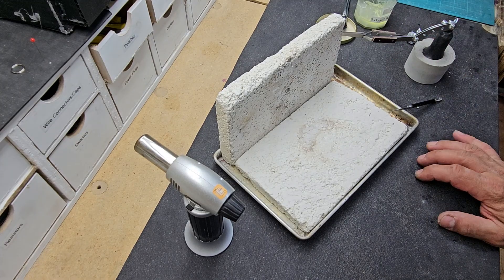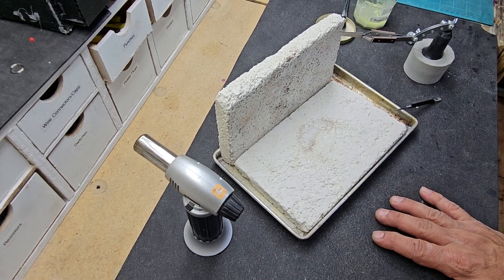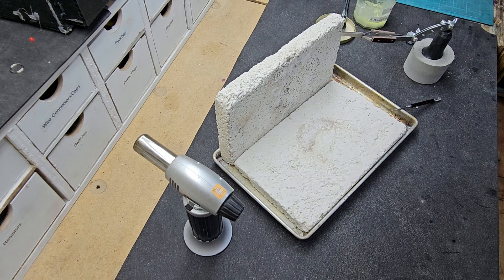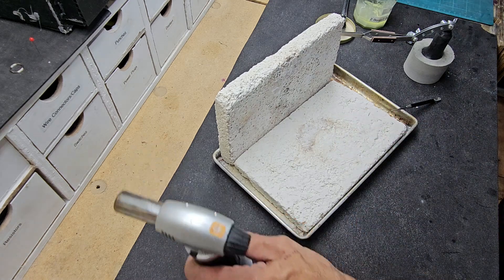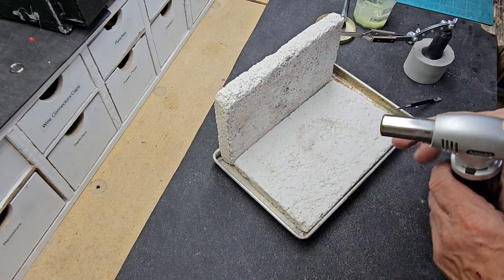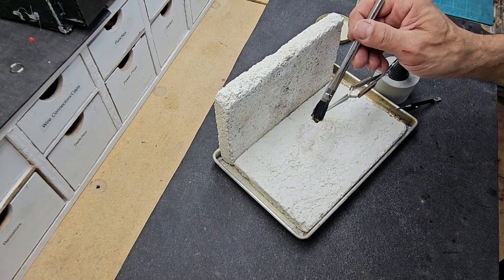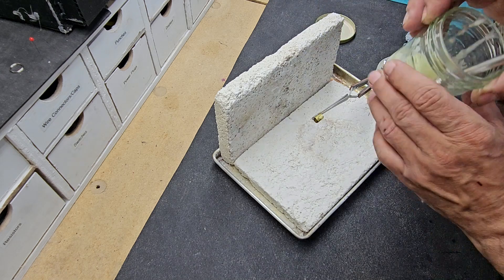Apologies — I lost the initial footage where I tested out these soldering blocks. It's been a couple of months; my videos are filmed and edited a few months before release. So I've used these blocks quite a bit. The flux I'm using is two parts borax, two parts boric acid, and one part TSP, mixed with some water to make a paste.